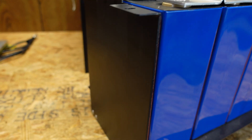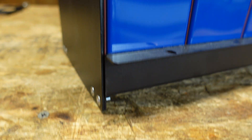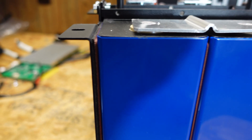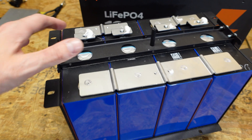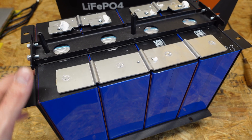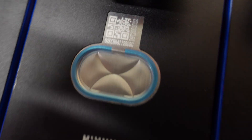Talk about a reinforcing build. They've got a steel plate on the end, in addition to the steel frame in the case, that's screwed down to a bottom tray with a lip, held in place by four screws so you can remove it. There is foam padding between the cells and the steel plate, and it's actually loose in there a little bit — so we know these are hopefully brand new cells that haven't expanded at all. Otherwise, we'd feel some tension in there. So now we can see our actual cells, and here's a quick look at the QR code.